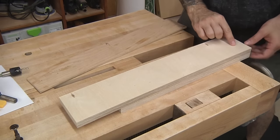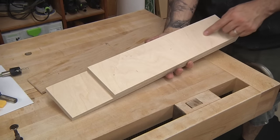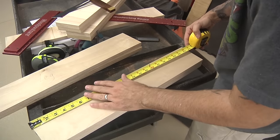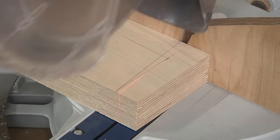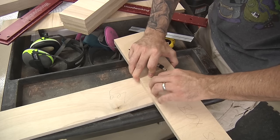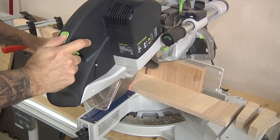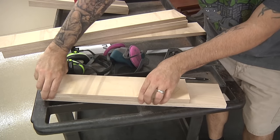Let's focus in on the table legs. Each leg is made from two pieces, and at each end will be a five-degree cut giving the legs a slight angle. The inside piece is cut shorter to accommodate the table box. Cut one end of all your leg pieces at five degrees. On the long leg pieces, measure up from the five-degree end 22 inches and extend that line across the workpiece. You can use a bevel gauge to show exactly where you'll make the cut. Now cut all long leg pieces to that 22-inch line at five degrees. Using one of my short table apron pieces as reference, I draw a line representing the length of the inner short leg piece, then use that line to set up the saw and a stop block. When we place a short and long leg piece together, it should look like this — so let's glue it up.